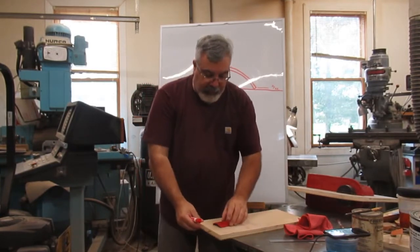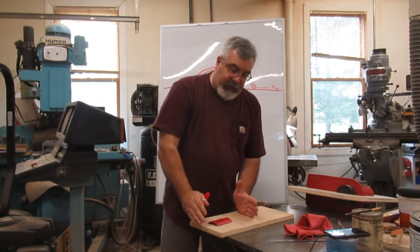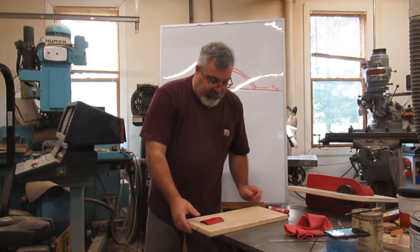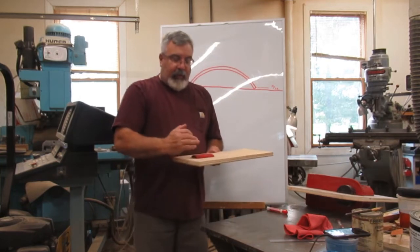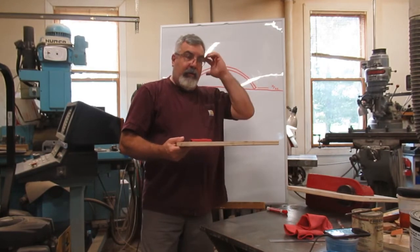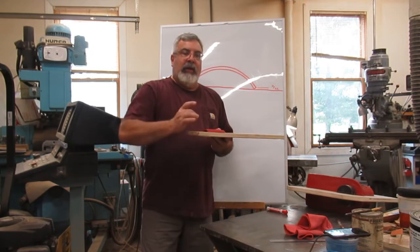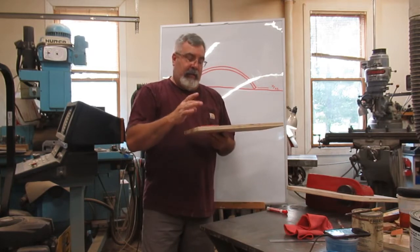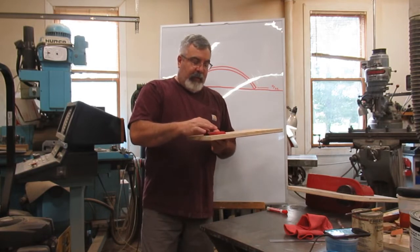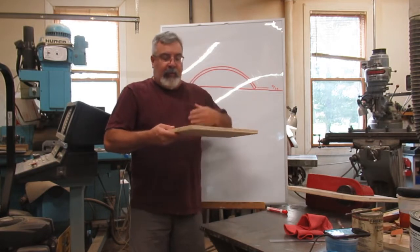So I'm going to have to get some 3/32 stock. What I'll do is, a couple ways you can do this. I'm actually going to cut this a little bit smaller, not too much smaller. Okay, it's going to make it easier for me to work. So what we'll do is put a couple 3/32 pieces on here. In here too, again, I don't want to make it too big. I want to try to be able to get 40s on a match plate.